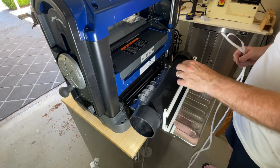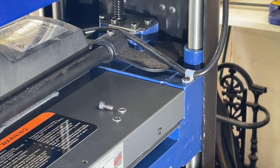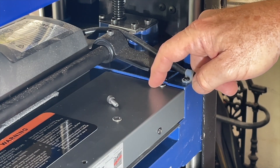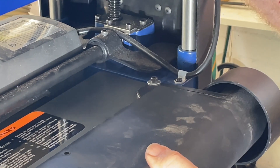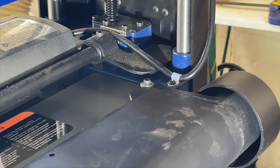With all the foam in place it was time to have a look at the mechanical construction. Here you can see the inner manifold sits a little bit below the cast iron, which is not ideal. So by placing a smaller washer below the plastic with a larger washer above the plastic, I get a much better mechanical attachment and I don't deform the plastic.